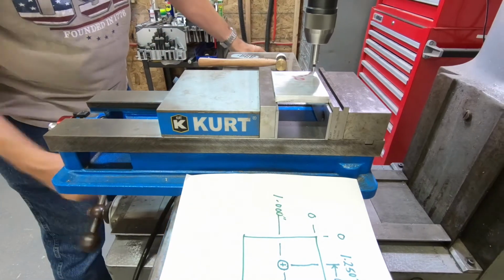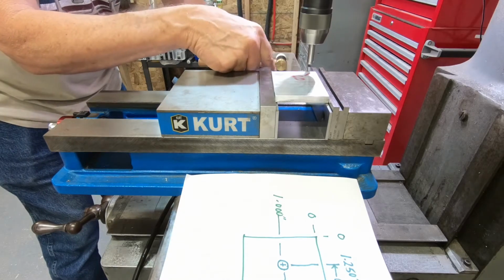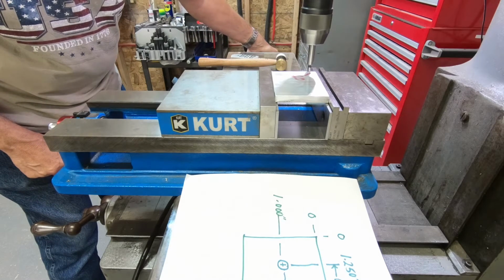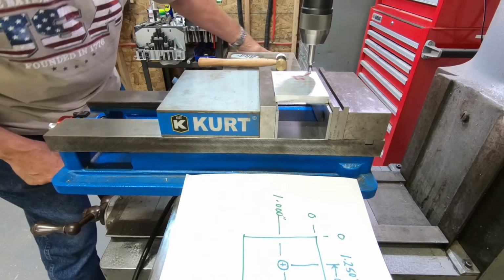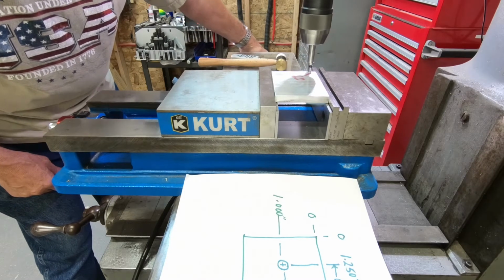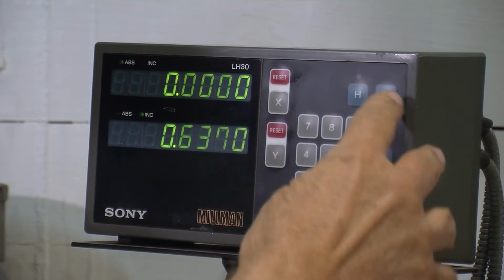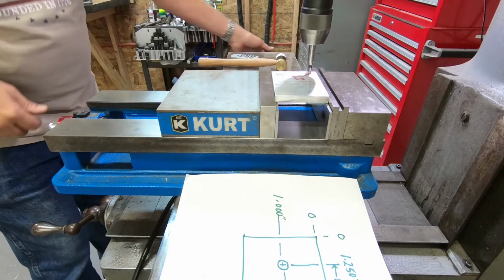So I'm going to come over here and touch that till this thing is wobbling, see? It'll straighten out and it'll move. So bump over. That's where I want to be. Right when it bumps over. So at this point, this is the x-axis, so I'll do x, I'll do the datum point, so that's my 0 there. And what I'm going to do is test it, make sure.